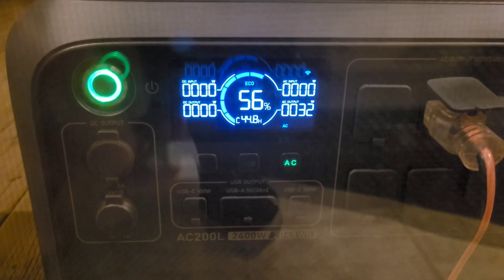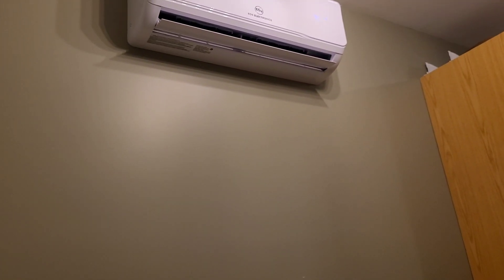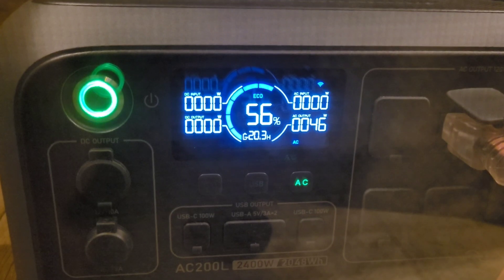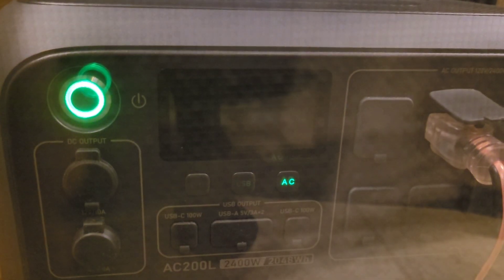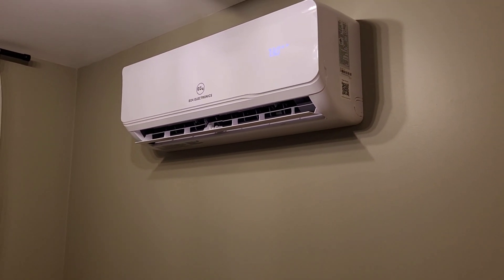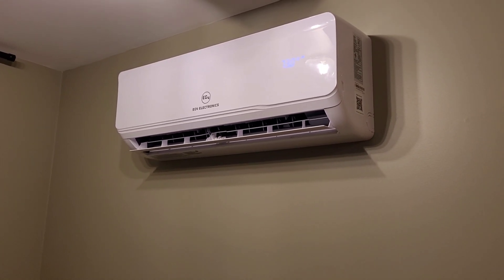It's 7:45 PM. We've been running for an hour and 40 minutes and we're down to 56% battery. I just caught this thing coming out of a defrost cycle — showing about 50 watts right now, but it'll ramp back up in a couple minutes. It will go into high demand again after a defrost cycle, probably ramping right up to 750-800 watts. Before the defrost it was around 450-500 watts. Looks like we should be good for around three hours total.